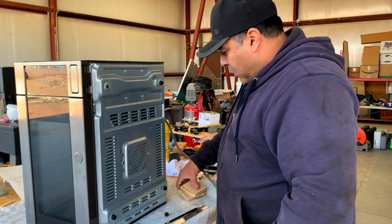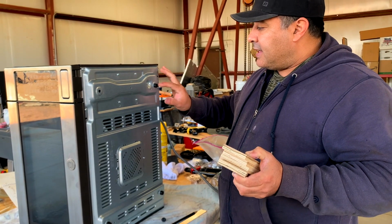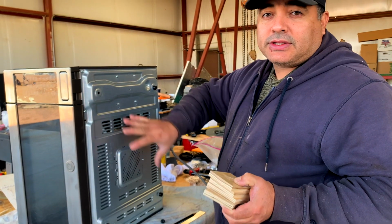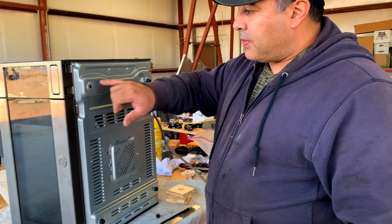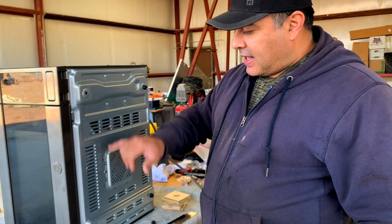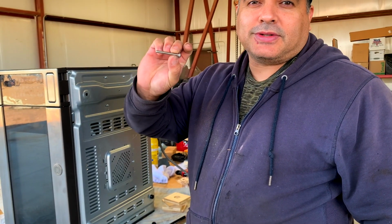So we've already just made 4 little spacers, and they're just made out of wood, and they need to be spaced because this is lifted from the factory because there's a bunch of vents down here and there needs to be airflow around the unit. So anyway, we've made these spacers, we've drilled them out already, and we're going to put a riv nut in here. We're going to try to position it in there the way we want, and then go ahead and drill 4 holes to mount these stainless steel bolts through. So that's the plan for today.